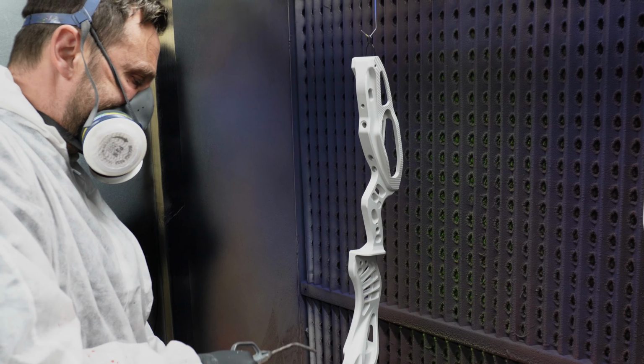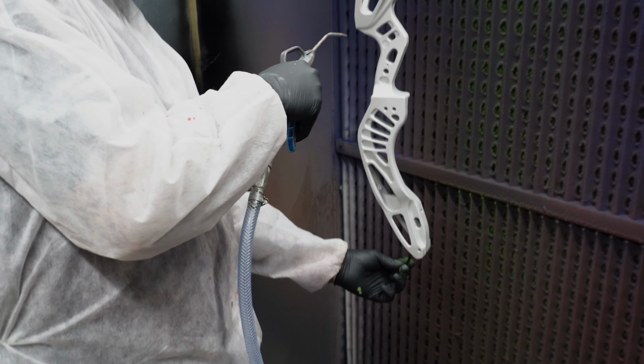The colour consistency, because with anodizing they're dipped in a tank and they have to be in for a certain amount of time. If you take them out quicker or later, the colour shades change. So you're not always going to get the perfect colour every time. The other good thing is if we do get a reject in the Cerakote, we can now refinish it in-house, strip it off and repaint it, whereas before we'd have to get them back from the anodizers, check them all off, and then send them back to the anodizers, which would then be a longer process,